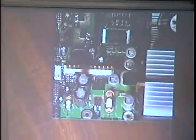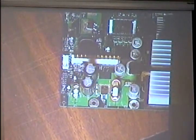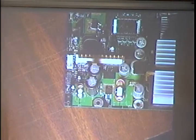1.6 boxes are really hard to modify right now. The mod chip makers are coming out with some things that you can use a mod chip for them. I think all the soft mod stuff works on the 1.6s. TSOP flashing does not. And I don't believe cheap mods do either. Somebody may correct me on that. But best thing I can tell you is just get an older Xbox. Try to get a version 1.0 or 1.1 with a 1 meg BIOS on them.